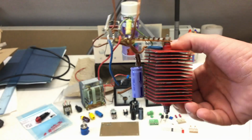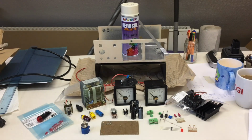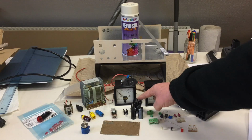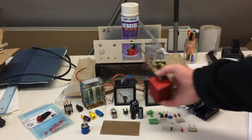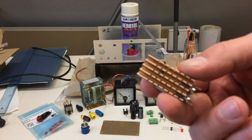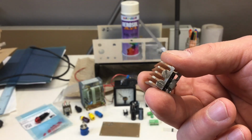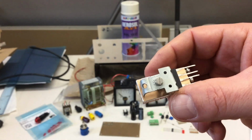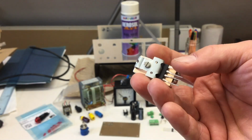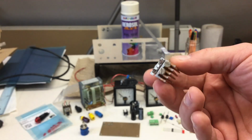Yeah, that monstrosity will be replaced by a perf board and bigger capacitors, and especially the rectifier, which I fiddled with a little bit there, will get replaced by this here. I cut that out from an old processor or chipset heatsink, and a new bridge rectifier, and the clamp is all very improvised, but it will do the job.